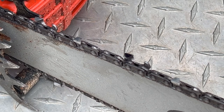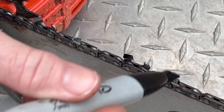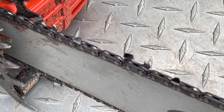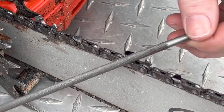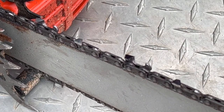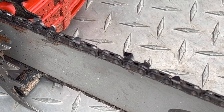Now, the way I do it, I'm sure anybody who has experience doing this does the same thing. I'm gonna mark this tooth here, which is on that side. I'm gonna mark this tooth here, which is on the opposite side, this side. That way I know where to stop, where I started. Pull the chain brake. Some people wear gloves. And I usually get on the saw like this, you know, and on these older trucks versus the newer trucks, man, they're lower. I mean, this is a 3/4 ton Ford 89 model, and it sits low enough where I can get in here about right. I put my glasses on,